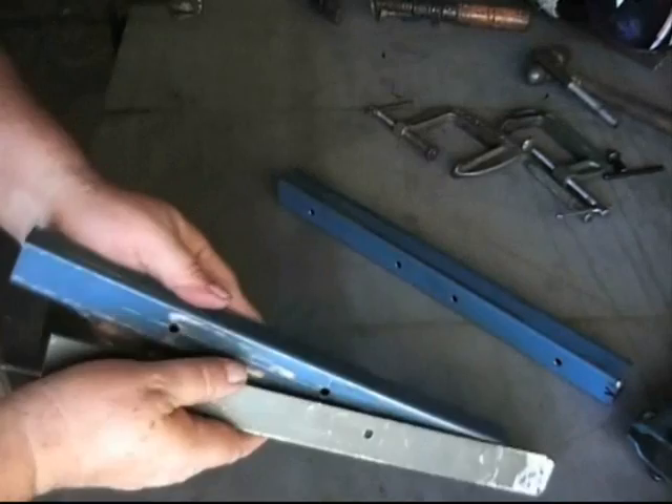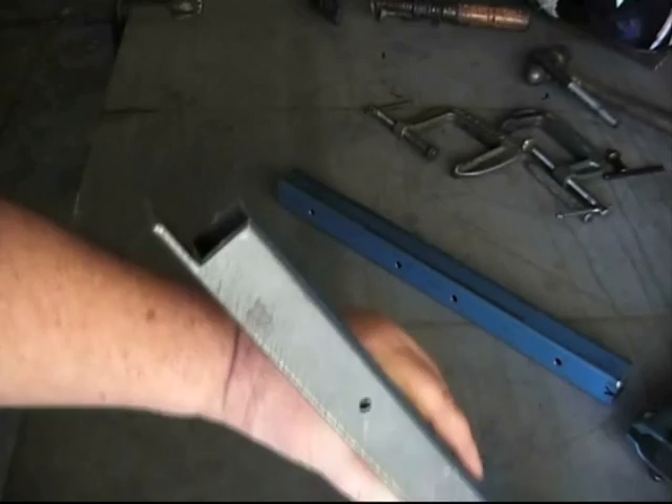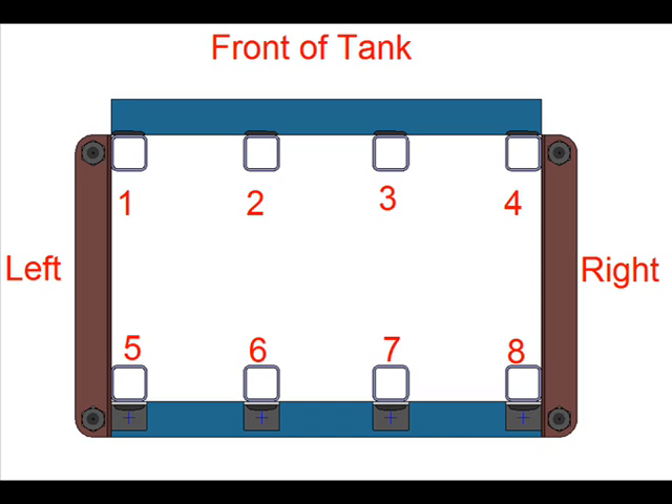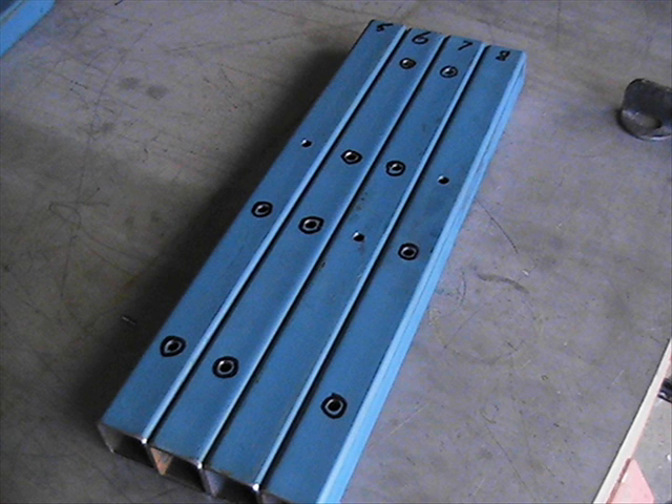The location of the holes are also different. So instead of making another jig, all you have to do is transfer the holes to the other flange of the jig and cut that flange to suit the length of the shorter posts. This diagram shows a plan view of the transmission frame with the orientation of the posts and their locations, with posts 1 through to 4 at the front of the transmission and posts 5 through to 8 at the rear of the transmission.